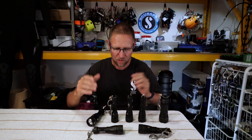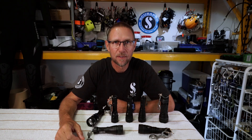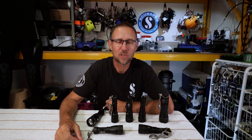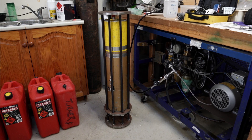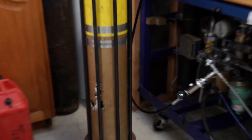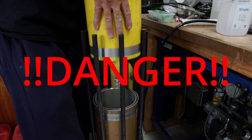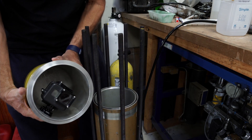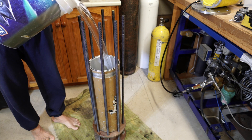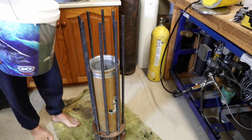In front of me I have a collection of backup lights which I put in the pressure pot I built. The pressure pot is a diabolical device I cannot recommend to the home builder, so I got an engineering shop to make it for me. It's basically made from two scuba tanks cut in half and joined together with an o-ring seal, clamped together with big threaded rods, bolts, washers and end plates. I pressurise it with water, not air, so that if something gives way, just a bit of water squirts out — the same way as a hydro test.